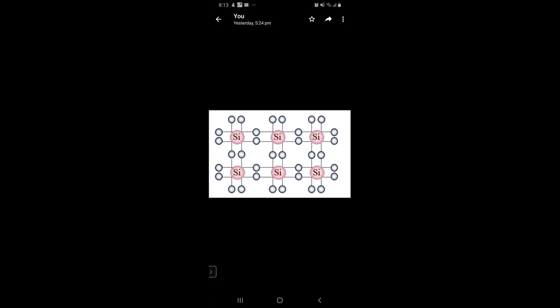Do you get me? Okay. So that is why, because we are using semiconductors, the conductivity will increase as we are increasing the temperature. And as conductivity increases, meaning resistance will decrease, meaning that if you increase the temperature, the resistance will decrease. Right? I'm repeating myself. As the temperature increases, the resistance will decrease.